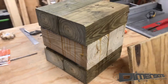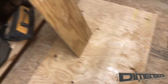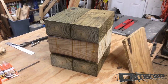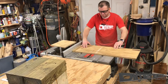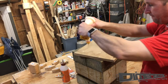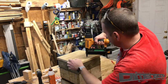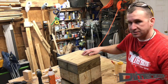The base is serving its purpose but it's pretty ugly, so what we're going to do is laminate it with a little bit of three-quarter plywood. That's going to give us a couple of things: it'll add more weight because three-quarter is quite heavy, and then it's going to encase the base — because although we're not building a piano, this thing is going to be in my shop and I don't want it sticking out like a sore thumb. We'll put a liberal amount of glue on there and use 18-gauge 2-inch brad nails to hold it in place. Make sure you do not add any mechanical fasteners to the middle — stay to the extremities, and you'll see why in a little while.